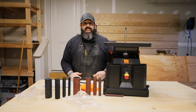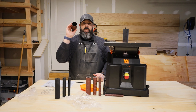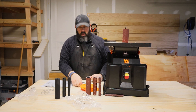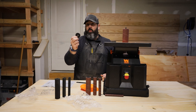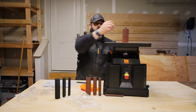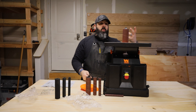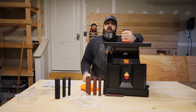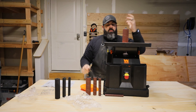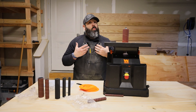Put the throat plate right on top. Next, the sanding drum should fit right on there. Next up is the 80-grit sandpaper. After that is the washer — the two-inch washer that goes with the two-inch spindle sander. Put that on top. Pretty simple to do. Next, put the nut back on. In your kit there is a tool you can use to tighten the nut. You will have to hold onto the spindle sander so it won't move. Go ahead and tighten it down — just arm tight from there.